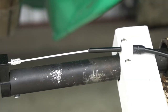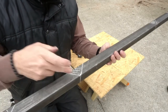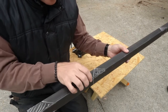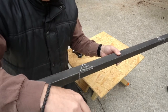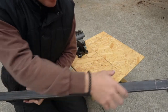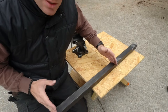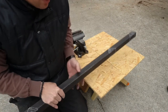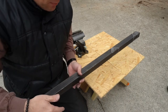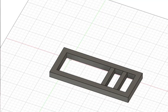There are a couple of additional pieces that aren't here — we'll see them later. The idea is on the steel pipe we'll do 45 degree cuts, leave a lip on the other side, again 45 degree cuts, and then bend the metal to form a 90 degree angle. This will become a 24 inch segment and a 10 inch segment. Then I'll take one more steel pipe to create the other side of a rectangular frame, and around that frame there will be some stiffener bars for the motor. Let's start cutting.